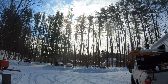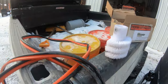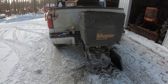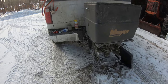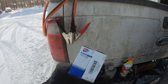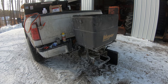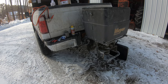How's everybody doing today? Thanks for tuning in for another video. As you can see we've got some nice weather here, and we're going to use this time to do a little work. As you guys have seen in the past, I salt most of my two biggest accounts with five gallon buckets. Recently bought this used Meyer salt spreader — I believe it's the 240, they call it that because it'll hold 240 pounds of salt. Today we're doing a little maintenance, wiring it up with jumper cables, putting a switch in the cab, and once it's all hooked up we're going to put some salt in it and actually go use it.